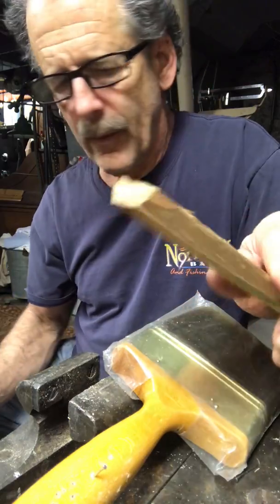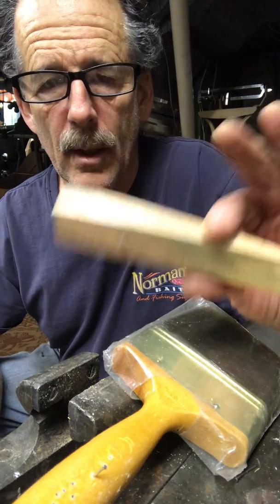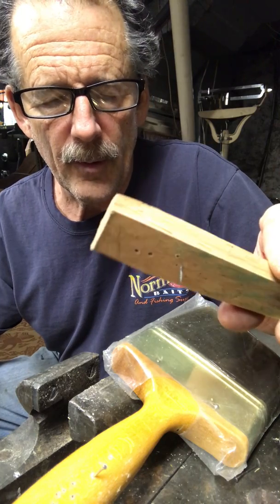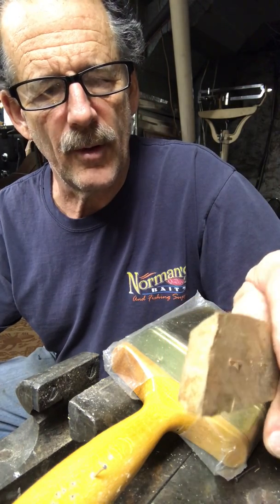When this shelf was put together, I'm sure it was put together while the wood was still green, because everything was just nailed together, and you can't nail hardwood together once it's dry. But when it's green you can nail it all together. Those nails were square, and you don't drill holes with square nails — you just drive them in.